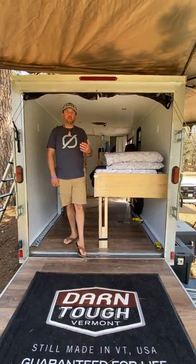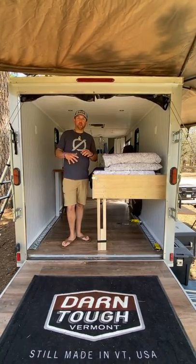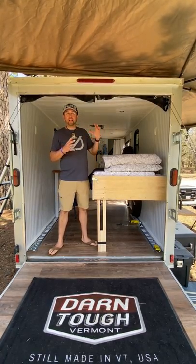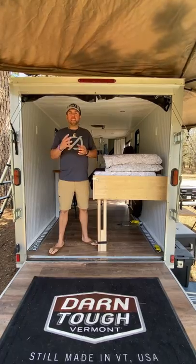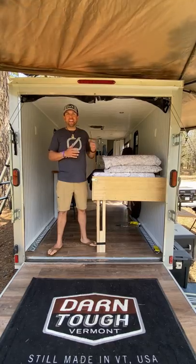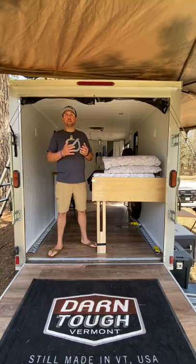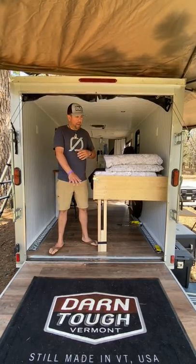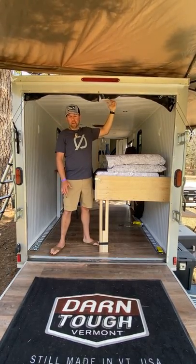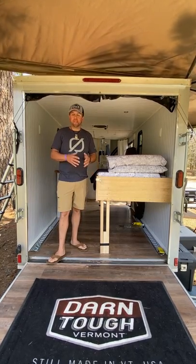Now we're going to the inside — this is where all of the work really happened. I took a cargo trailer, pulled all the walls off, checked all the electrical wiring, went through and found any holes, screw holes, any creases that had light coming in, sealed them off, insulated the trailer, ran electrical wiring through it for electrical plugs, lights, and fans. Then I went through and put a nice beadboard down on the walls and also on the ceiling with liquid nails, and for the floor I did a floating floor with luxury vinyl plank that has a 20-year warranty on it.